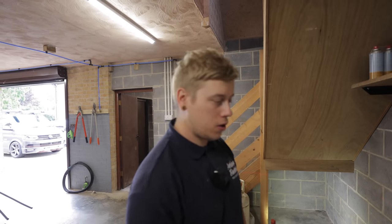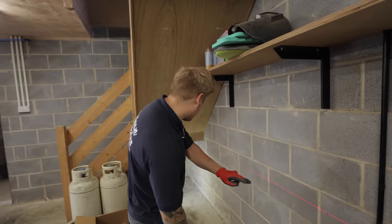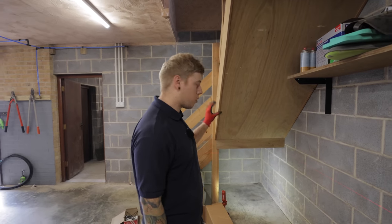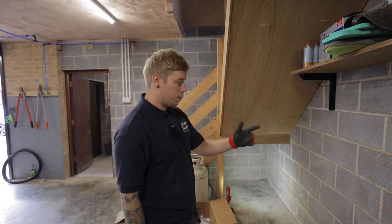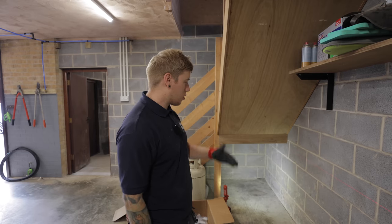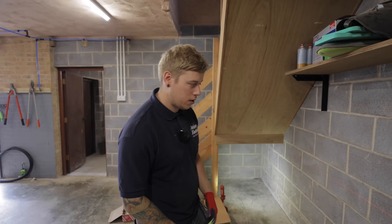The first bit's done and over to the column. I've set the laser up off the T-piece and I'm just going to get this bit done under the stairs, pop through to next door, and then I'll concentrate in this room. It's pretty much the same thing - get your laser line, mark out your saddles, cut your conduit to size, get that on and just move on to the next area. When I'm in the next room I'll show you something interesting in there.